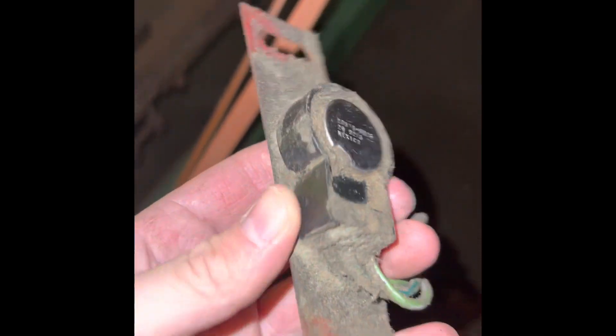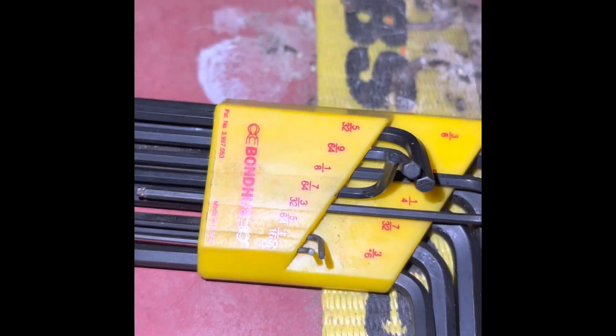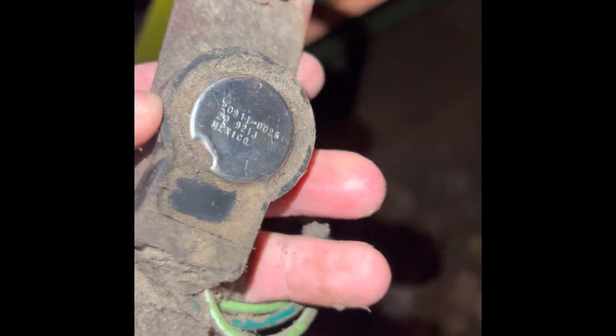So we got it off — it's a 5/64th hex key Allen wrench. That'll take that set screw out. Then you can take the whole bracket off and do it this way. This is probably easier to make sure it's clocked about the same as the old one. Now you've got this nut that needs to come off, then the whole pot should pop right off. That's a 9/16ths. Get that off and then get your new one on.